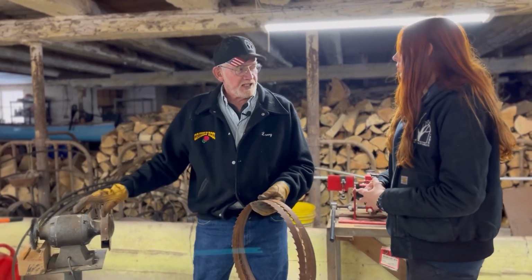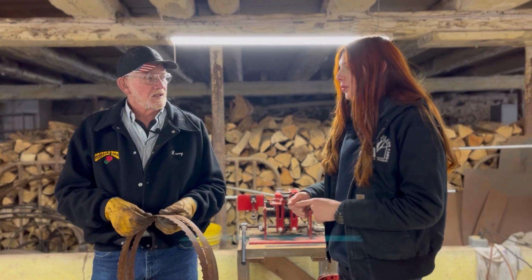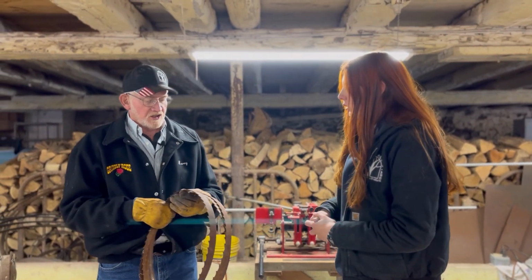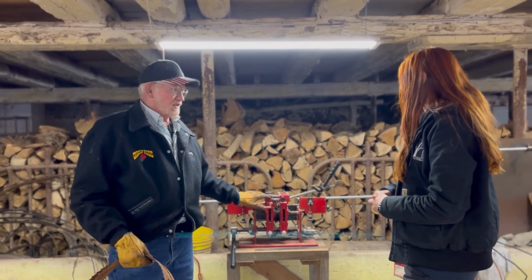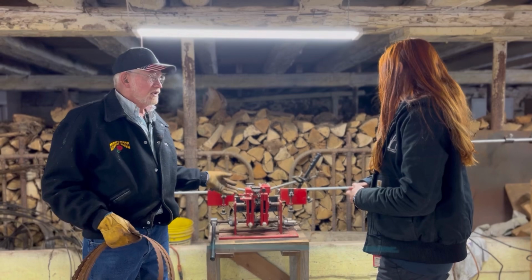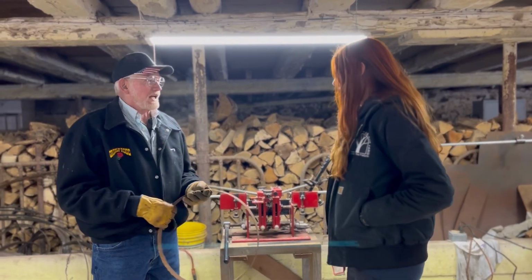It depends on if there's a lot of pitch on the inside, especially where the wheels pack it on there. So I clean that up. We actually haven't been using soap in our lubricant, and that's supposed to help clean it off, so it might be worse. Well, it's good to do that because the tooth set is measured in thousandths. It takes very little on here to change that 2 or 3 thousandths. So it's a good idea to clean them, and I go over them pretty close initially, because otherwise you get erratic readings.